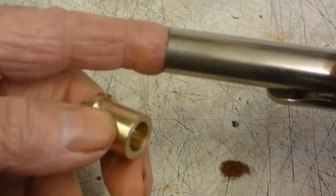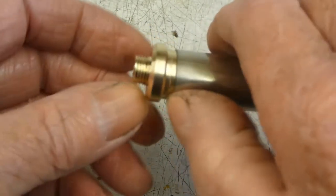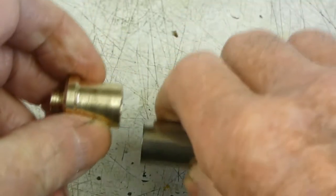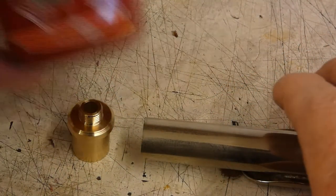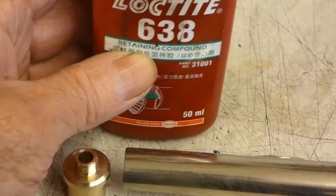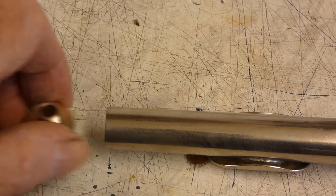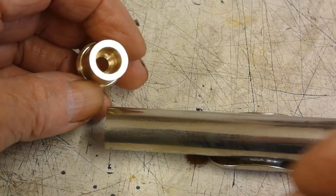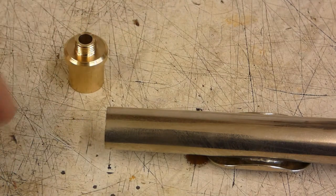Now as the inside is a taper, I've made this a loose fit, but you can just see the ridge on the end there — that's a tight fit, just a press fit. It may be a bit longer than necessary, but I shall still be using an adhesive to hold it in place, and this time I'll be using Loctite 638, which is designed to fill empty spaces around joints. But I'm not going to do it now — I'm going to do it after everything's completed and I'm wiring up, because getting the cable through and then up through that hole at the end might be a bit easier if it's not in place, and then I can glue it in afterwards.